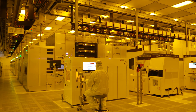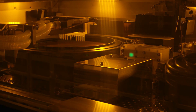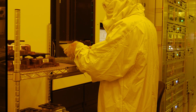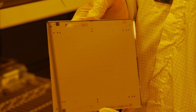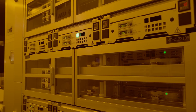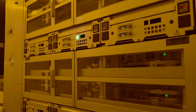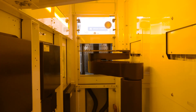Our photo tools are some of the most sophisticated equipment in the fab. We start by coating the wafer with a light-sensitive material called photo resist. This is called a reticle and it contains the specific pattern for one of our products. We put the reticle inside a photo tool like this and shine ultraviolet light through it. Like camera film, the light exposes the resist to imprint the pattern on the wafer. Then we remove the resist and use liquid or high-energy plasma gas to etch the pattern onto the wafer.